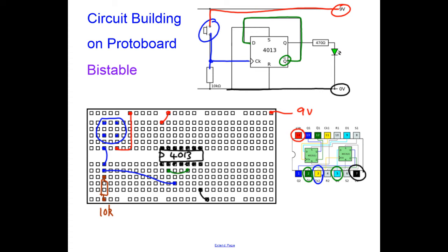Q-bar, which is pin 2, connects round into data at pin 5 — although it's a long line on the circuit diagram it's a very short connection on the protoboard. When making small connections between pins I often keep wires close to the chip. The set and reset are both connected to 0 using black wires — reset is pin 4, set is pin 6. I need a 470-ohm resistor from Q (pin 1) going to the LED. I'll work across the board to the LED with the flat side down to ground. That is my bistable circuit connected.